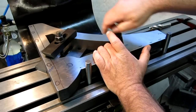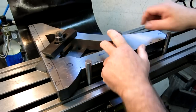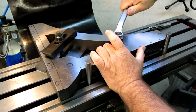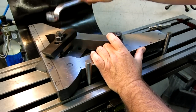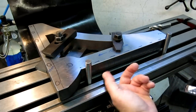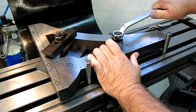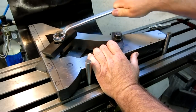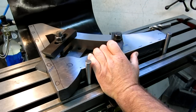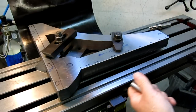So I'm just making sure the studs are straight, and I'm pulling up against these pins here. So we're bearing against that. Okay. Snug these down a little bit. Now I've got dual parallels under both of these. You generally don't want to clamp over air. That means unsupported material. It tends to bow the piece, and it can also cause things to move. All right, so that should be plenty. All righty. And these should come out, okay.